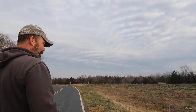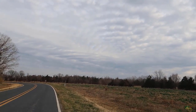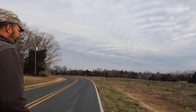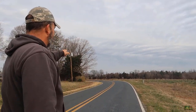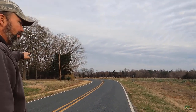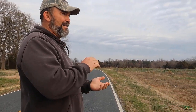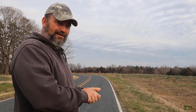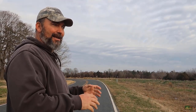I mean, obviously, it's all by the foot. Okay. Well, the gravel is. Yeah. And what kind of gravel? I mean, it's just regular gravel. Well, there's all different types of gravel. Okay. The driveways are built out of ABC stone. We put that down first because that has dust in it and that packs. You understand? And then the rest of it is just decorative. Anything past that is decorative.